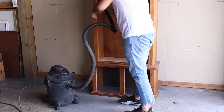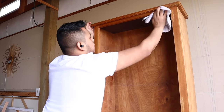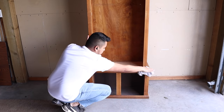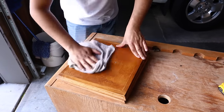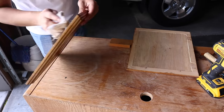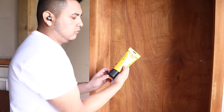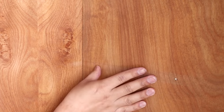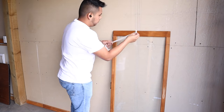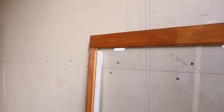I do not consider myself a professional furniture restoration person — I'm kind of just going about this from a DIY standpoint. I'm going to clean everything off with a damp rag just to make sure there is no dirt or grime. It's always important to do that before you ever apply stain or anything like that. The gun rack left a couple of holes at the back, so I'm going to fill those in with this wood filler — what I like about this one is that it is stainable and takes about two hours to fully cure. I'm also putting some tape on the glass door to make sure no stain gets on the glass.